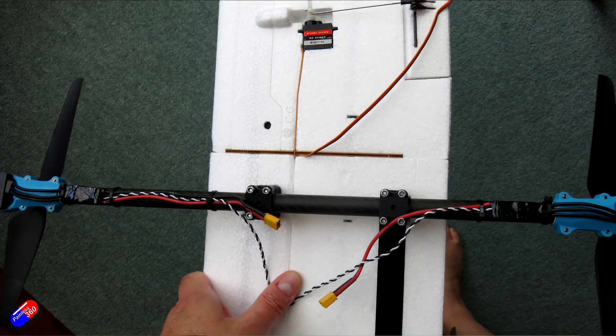That means when I get the Pixhawk ready in the next video and we start plugging things in, it's obvious where it all has to connect because we already know the output mapping from last time. The big thing is to make sure that the center of gravity is in the right place — in the middle of the bar between the two motors, which is also about where the CG on the wing is. We also need to make sure that the motor direction is the right way too. ArduPilot is expecting a certain orientation and it's easy when you're in the minutiae of assembly to get distracted and end up with the clockwise and counterclockwise motors in the wrong place.